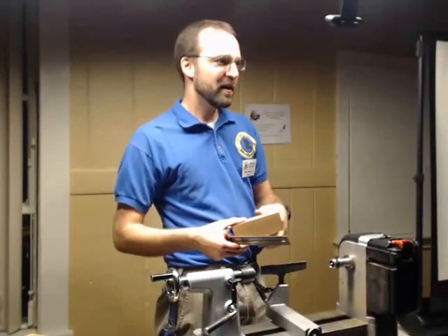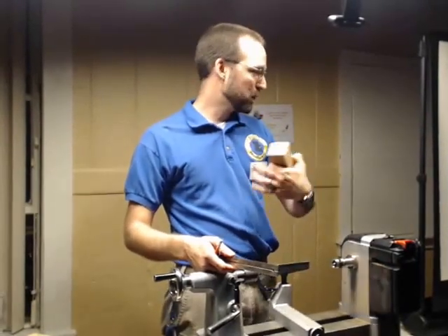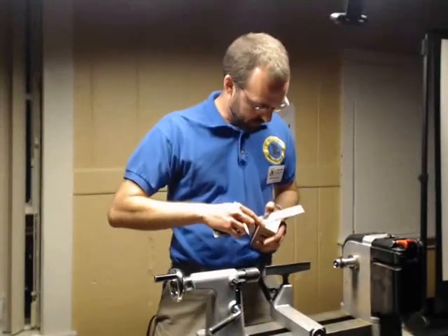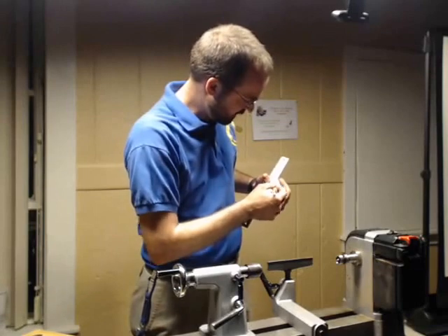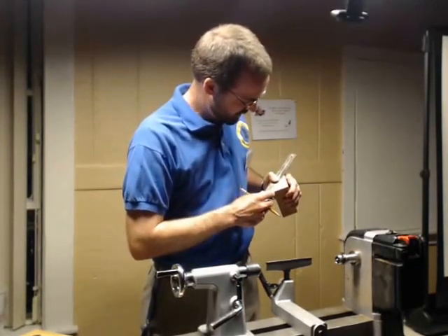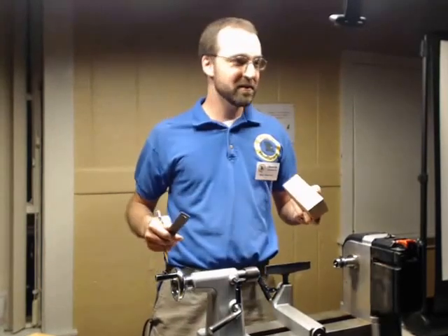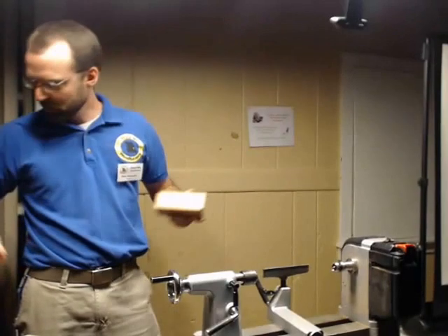Just something a little like this. If you're new to woodturning, before you mount a blank, a really good idea is to mark centers. What I usually do is take a ruler and hold it across there, go from corner to corner, and make a line in the middle. Then go to the other corner to corner, make another mark, so I have an X — and that X is about center. It doesn't have to be exactly in the center. We're going to turn away all that stuff anyway.